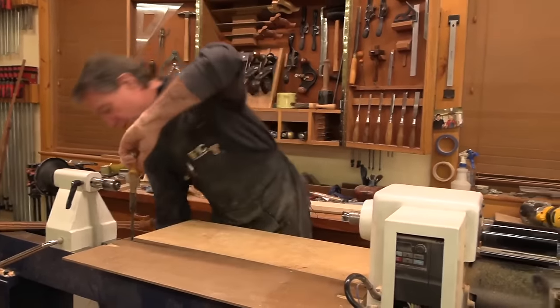to your other lathe. I mean, you may break it down and then just sand on the same lathe, or you can go to another one. You can see that if I put a straight edge on there, there is a roll to it, but it does kind of flatten out. The middle has the greatest arc to it, the transition, but then it gets close to straight that last bit. And that's why you can use the rolling pin to lay it up. It's one of the features I think that they naturally have, is they are a little flatter as you get out to the ends.